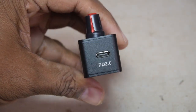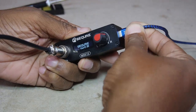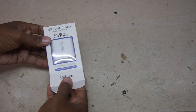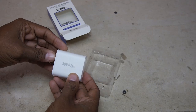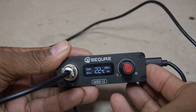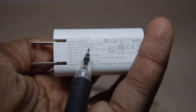You may have noticed a USB-C port on the side — it says PD3 power, but I tried it with a relatively powerful cell phone charger. Unfortunately, it just went into firmware update mode. A battery bank fared no better. I then sprung for a true Power Delivery 3 USB-C adapter rated for 30 watts. This time I was able to get the expected display screen, but when I started the heating mode, it just powered itself off and reset — it just wouldn't heat up. Bugger. My best guess is that 30 watts may not be enough to run the unit.